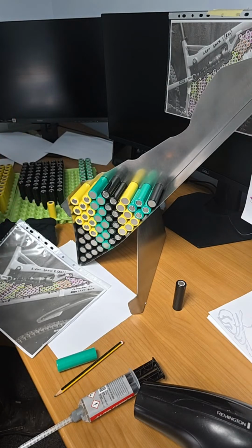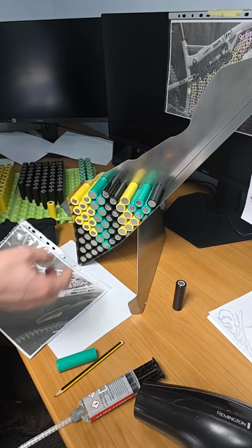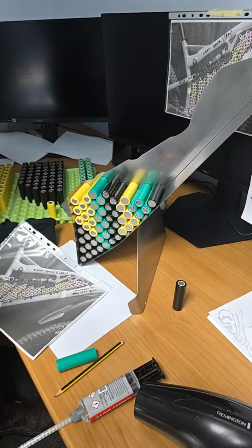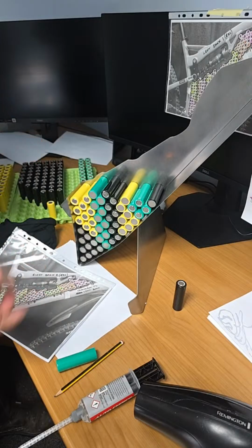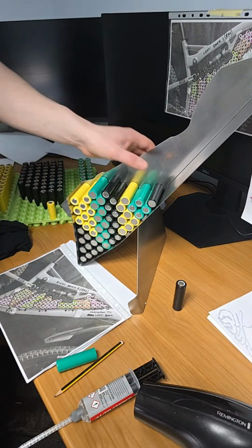I'll just point out this before going further, this 3mm plate is not welded directly to the capsule. The capsule is made out of 0.9mm stainless, and this 3mm plate is stuck with double-sided tape to the back wall of the capsule. Do get a look at my channel and you'll see the building of this in detail. I go through all the steps in fine detail like I'm doing here.